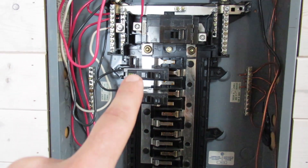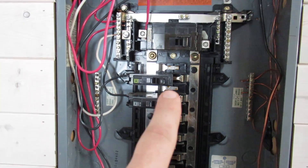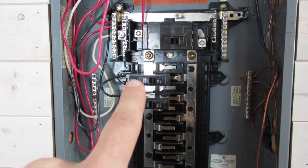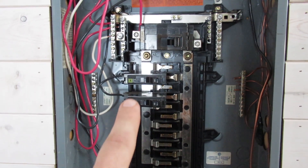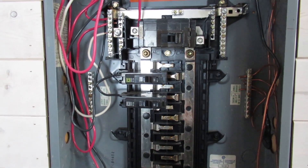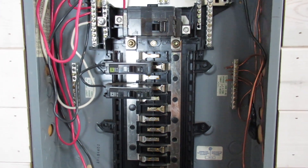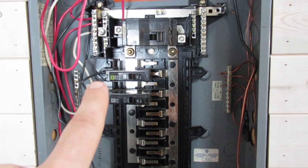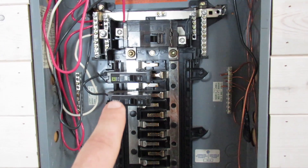The reason for having two breakers is that I have the cabin pretty much split in half — plugs and lights. So if one of these breakers fails, I'll at least have power and lights to the other half of the cabin. That's why I've got two; they're each 20 amps and they each power half of the cabin's lights and plugs.